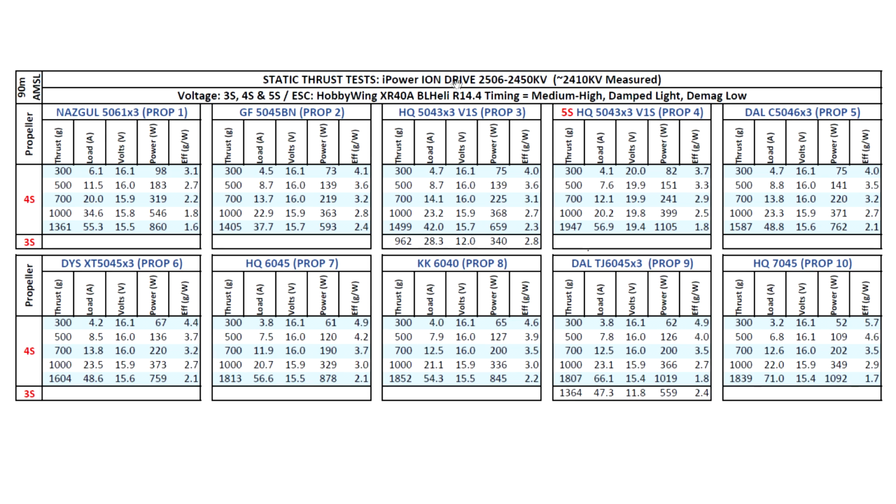So this one is yet another one of the large motors that have come out recently in the 25 millimeter class. Lately we've had 23, 24 and 25 millimeter diameter stators of various heights, going anywhere from 5 millimeter all the way to 7 and even 8 millimeters. So pretty large motors lately. Seems to be a little bit of a trend there.